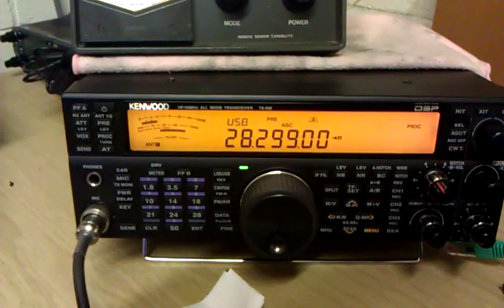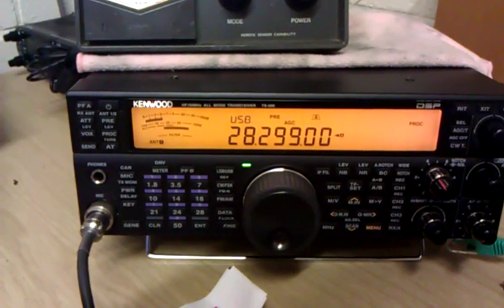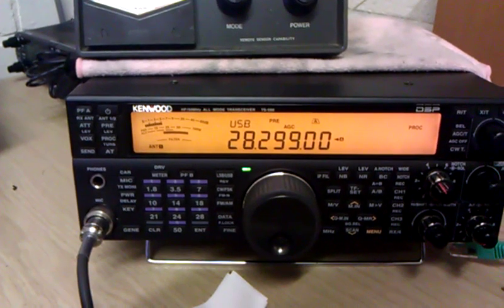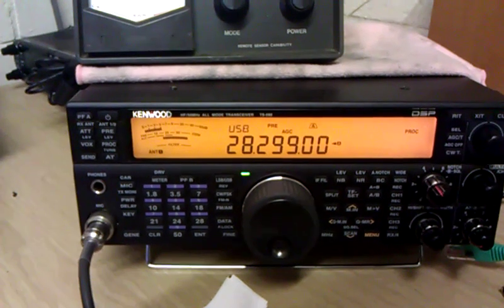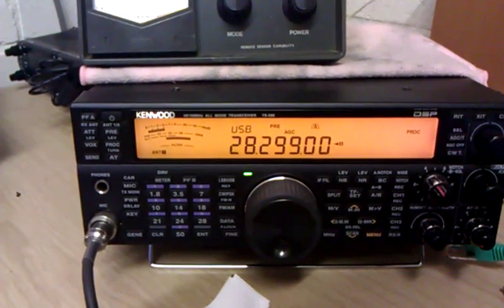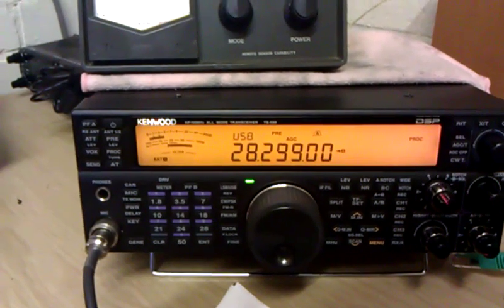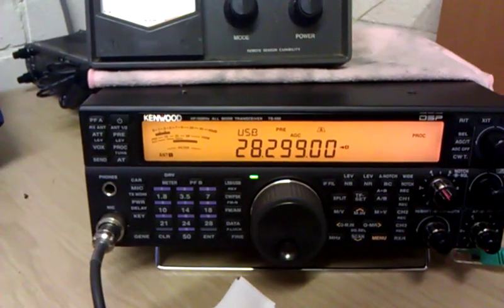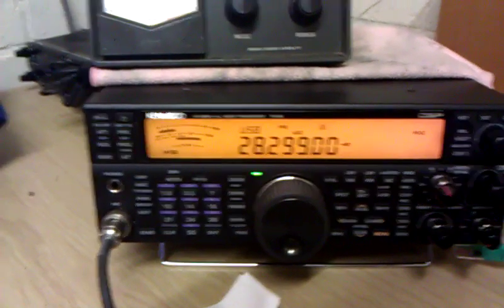Golf Victor Zulu, doing a YouTube video today to show how to measure SSB power properly. As many of you have seen on the forums, there are complaints that the Kenwood TS590 is only outputting about 60 watts average on SSB, and the reason for that is people are using the wrong meter to measure the power output. When you're measuring power output in SSB, you need to use a PEP meter that has a peak hold function. Your average normal power meter just doesn't do the job.